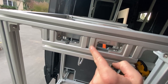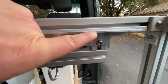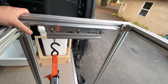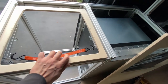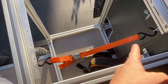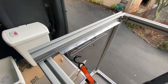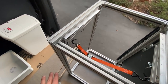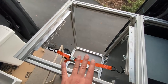Coming to the sides, I made this little miniature structure on both sides — it's exactly the same. It's basically an inch and a half of vertical mounting places. Since this piece of aluminum sits below this part of the extrusion, I had to create an inch and a half of mountable space here. It's only an eighth inch thick, but I think it's plenty strong for this application. Something that I absolutely love about this mechanism we just engineered is that it is completely adjustable — it can go up, down, front, back, side to side. I have a ton of adjustability so that I can align the sink with the cutout in the countertop and it will be just exactly perfect to the dimensions I want.